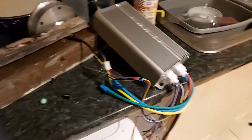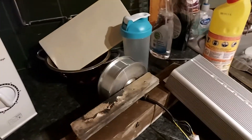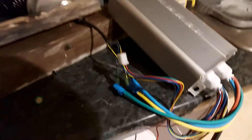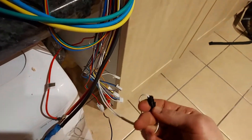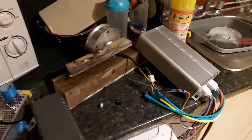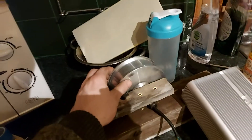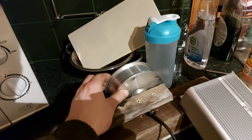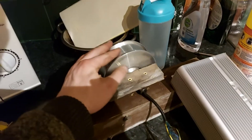So we'll try the self-study option. When I've plugged in the self-study, it sort of spins up, switches off, spins up again, and just keeps going. So we'll unplug the self-study cable. If you've got one of these in a project, you'll want to keep the wheels off the ground for this. We'll see if it still does that jerking motion with the hall sensors connected. No — it just doesn't do it at all. It's actually much more stable with the hall sensors.